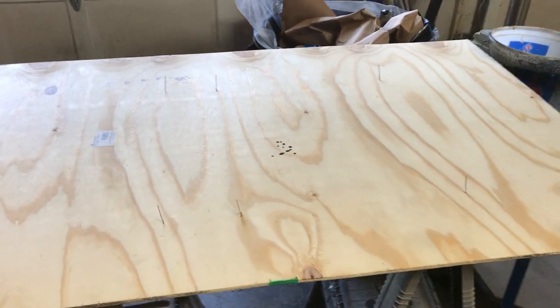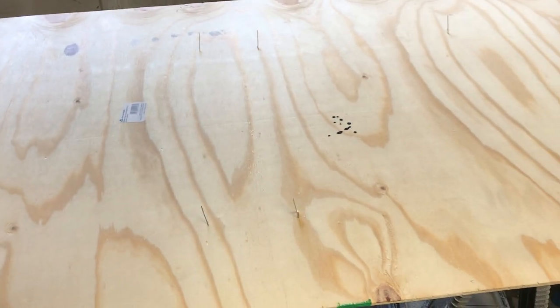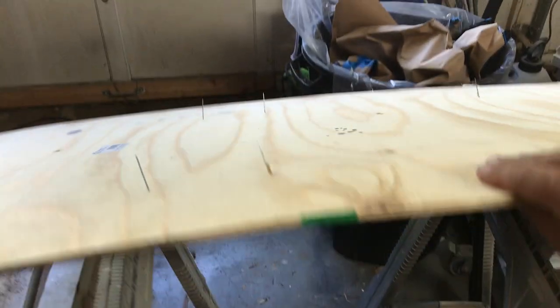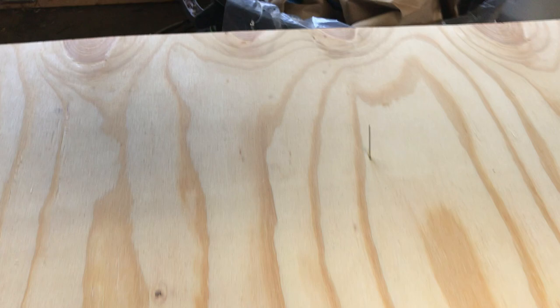I've only got a couple of doors to paint, and I need to paint the opposite side. Here's the doors that I've painted — this is a tricorn black color, and I just got two. I need to paint the other side, so what do I do? What I did was on the other side where I painted them, it's got an outline of the door. I don't have the plastic painter's pyramid, so I just shot some finish nails at each of the corners of the door.